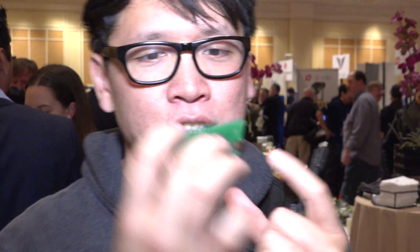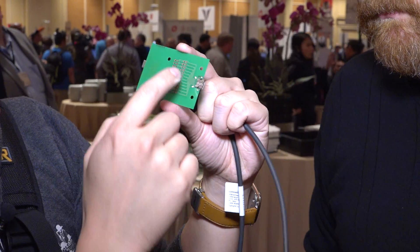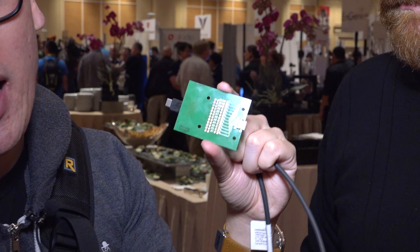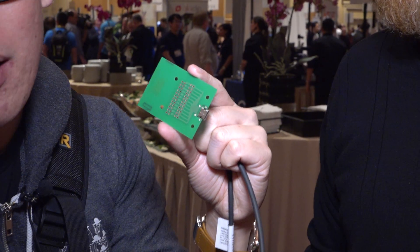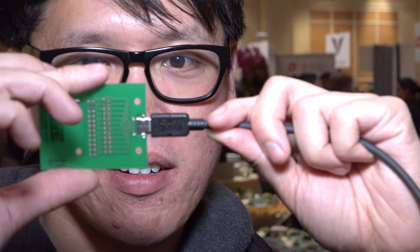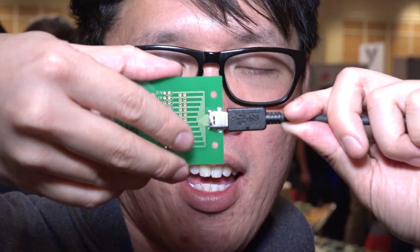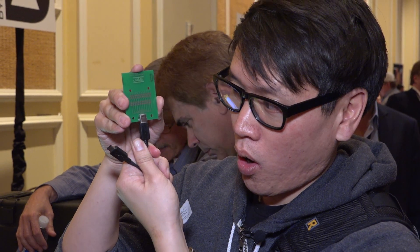So here is just a sample, the female side. This is a dummy card. And as you can see, it actually has 24 pins — A, one to 12 on this side; B, one to 12. They're basically the same on each side. There are two grounds. Four pins are on each side for USB 3, two pins on each side for USB 2. There's some power and ground, but long story short, you can plug it in this way. Wait, what? Or I'm going to flip this around, plug it in that way. There's no up or down. It's just an oval. I just touched the future.